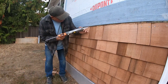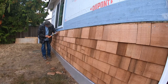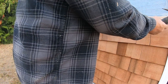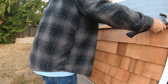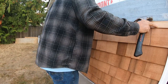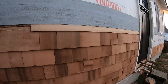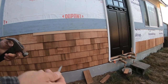I've got some of this clear Quad Max caulk here. I've got enough caulk underneath it where it's just kind of holding itself up. You can see the little angle — it tips up under there so the water can run off onto this one and run down. We're just going to tack that up with some little finish nails.